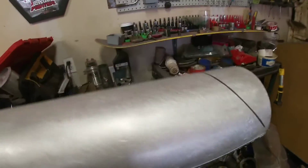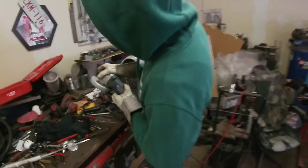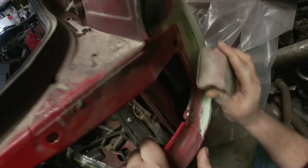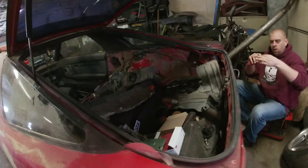What do you got going on here Mike? Finishing some intakes. We cut that end cap off — he's doing the angle right now. And Rob's over here too. The final step — we don't need brass, we can just tape it from the inside, tack the piece of steel to a screwdriver, just one little tack and we can hold it up through. Use one of the tiny little screwdrivers you use for glasses or something — super fast, yeah.